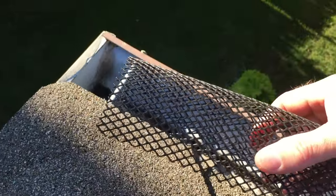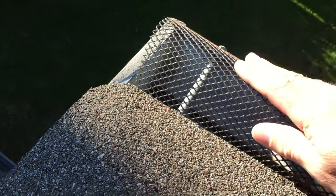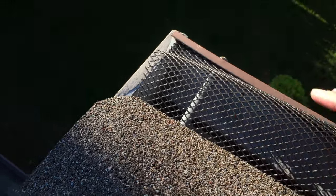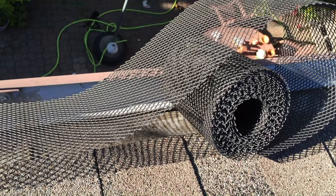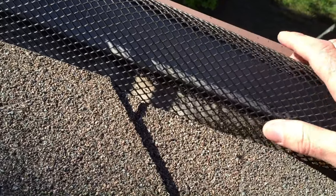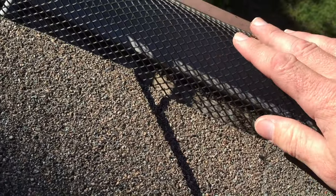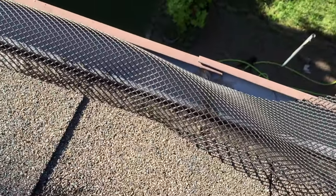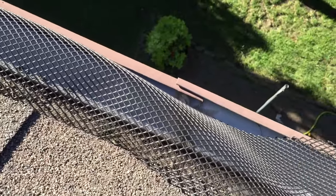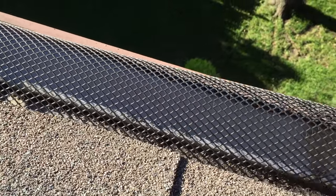What you do is take it and squeeze it into a domed shape going upwards, then place it into the gutter and push it down to rest in. I just leave the coil rolled back about four feet, sitting in the gutter, and work my way down pinching and pressing it in. It's a compression fit that holds it in. I've done other areas of the house gutter with these several weeks ago and they've held in place very nicely.